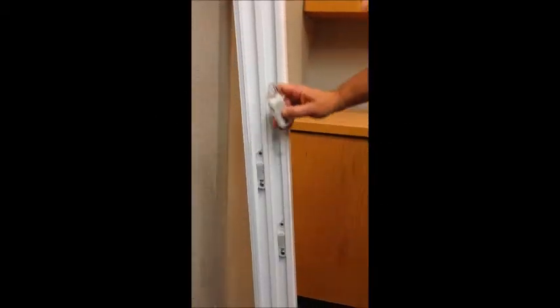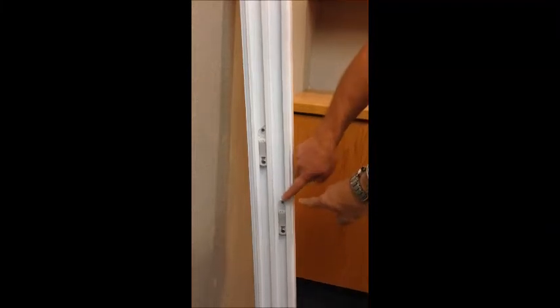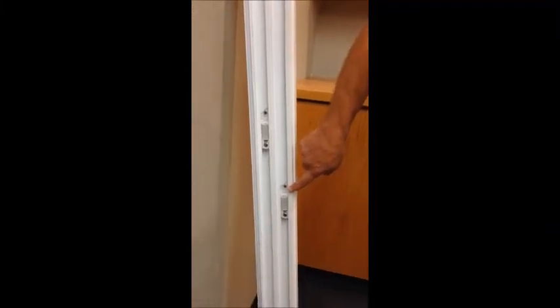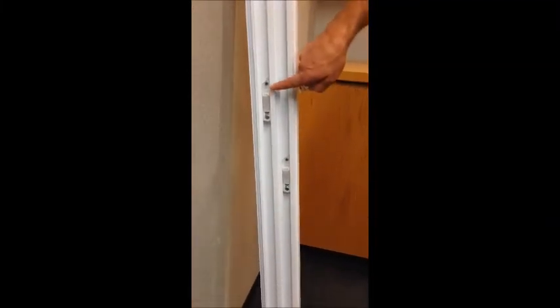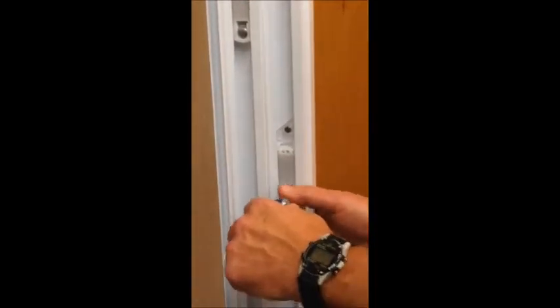Component, it's installed into the jamb pocket prior to the frame welding. At this point, you're seeing that the screw in the bracket has been tightened down and the cartridge is holding in place. Our next step is to actually pull the shoes down slightly and unlock them.